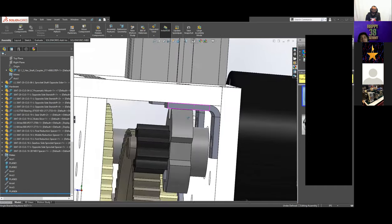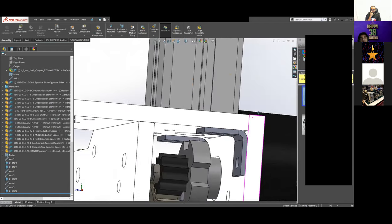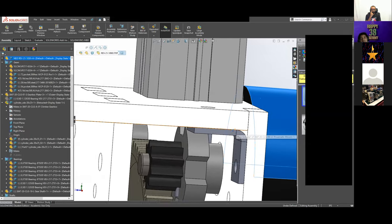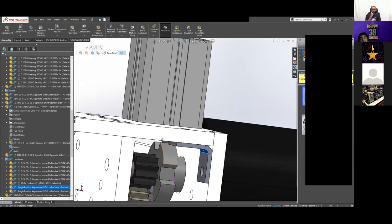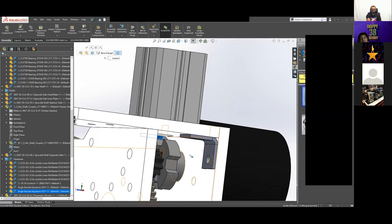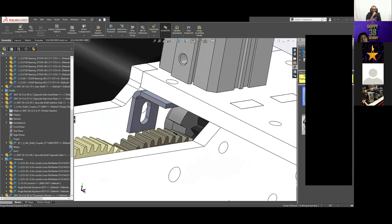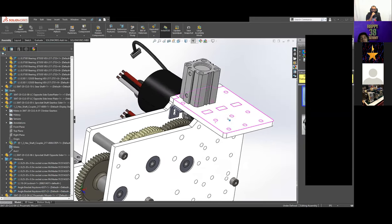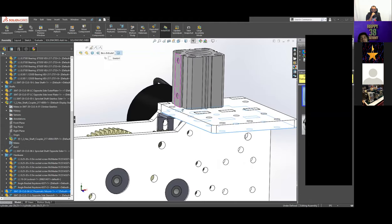Yeah. So here we would have used slots and T slots for bolts, but there's a motor here, so we couldn't. So we had to use right angle brackets here and here. And on the other side, you can't put the nuts either because it's up against the drivetrain. So on the other side, it just extends. And the bottom of this plate rests on the top of the side rail.